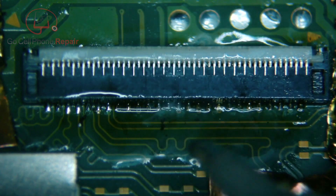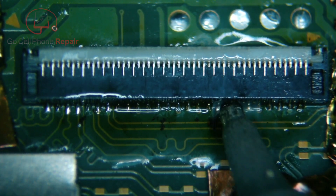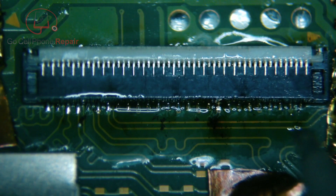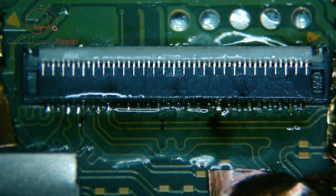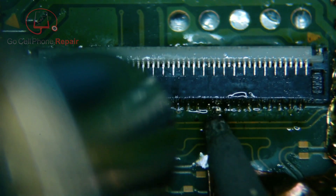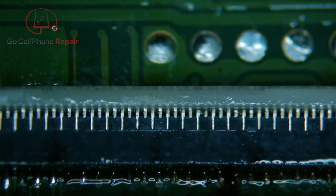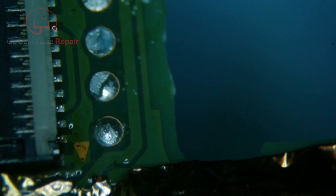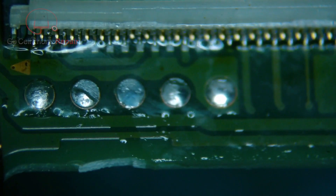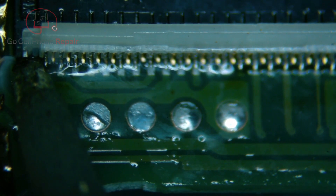Hopefully the camera is picking this up. It's kind of cool how these eventually flow. There are going to be a couple of ground pads that will be difficult, but we'll come back for those. For this one here, I think we're going to add just a tiny bit of air - probably about 200°C or so - and that should bring us up warm enough to get this thing to connect and flow together. There we go, that looks good. You can see these are making some really nice joints here - that was my main concern. Now we'll work our way around here and let's see if we can get this anchor connected. That's going to be a fun one too.